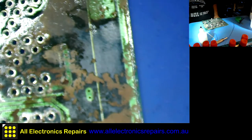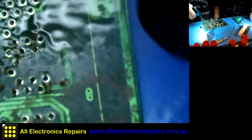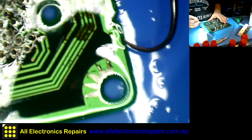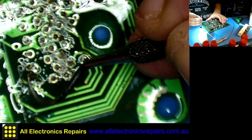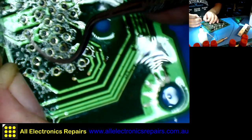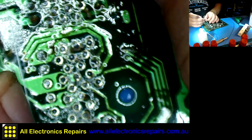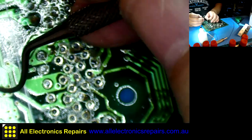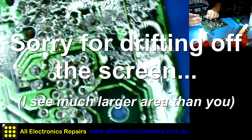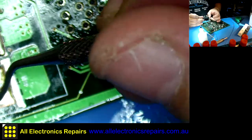I still have two pins to remove, but what I do first, I'll just soak it with alcohol. I'm using my favorite dental pick tool. What I do, I try to grab on that lacquer, and you see that's how it is easily removed. It's still much faster than scraping it, especially from between the pins. It doesn't remove itself as one bit, but still, it's not too bad. Most of that dirt is on this lacquer. Yeah, it's come away with it. Very good. So it is easy to clean.